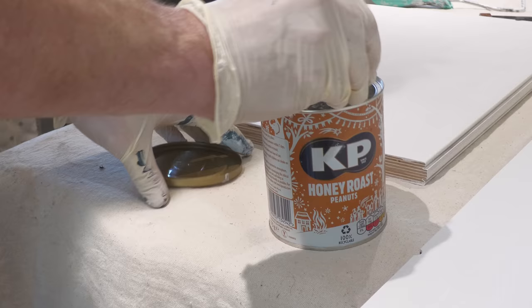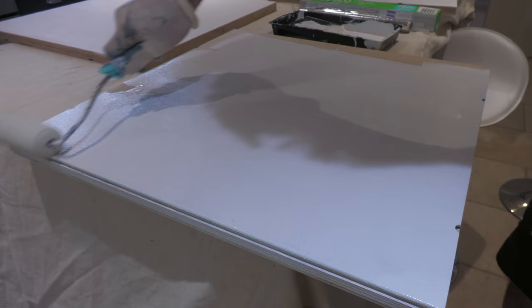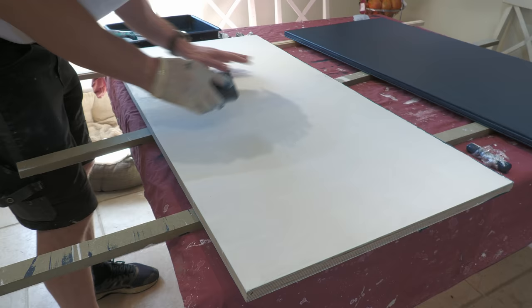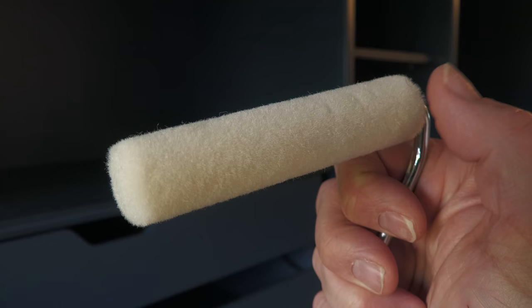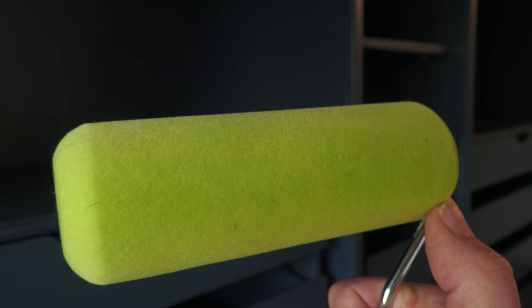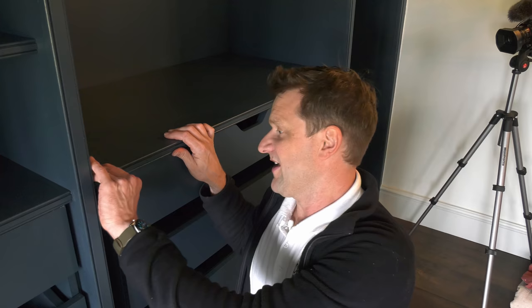For painting, I primed the ply with my shellac-based Zinsser BIN primer, using a foam roller sleeve I'd kept fresh wrapped in foil inside an old nut tin. I then gave the surface a quick light sand with 240 grit sandpaper to remove any raised grain, and after this applied two coats of the same acrylic eggshell Johnstone's top coat with my 100% wool simulation mohair mini roller sleeves. They're not as quick and easy as foam, but the problem with foam sleeves is they absorb so much paint and are much harder to clean. At this stage I haven't screwed these down - the adhesion of the paint is keeping them in position. The plan is to have the door soft-closing onto these tops, so I want to be able to fine-tune and take them out if necessary once I start experimenting with the doors.